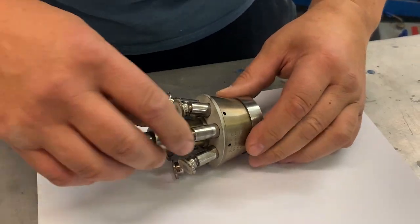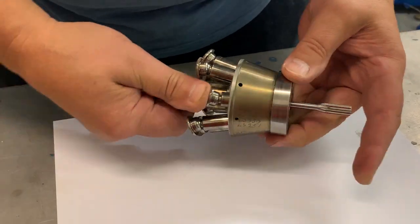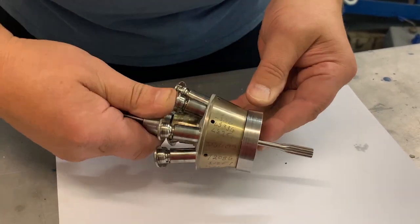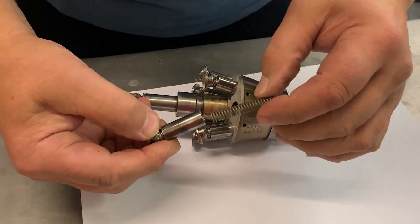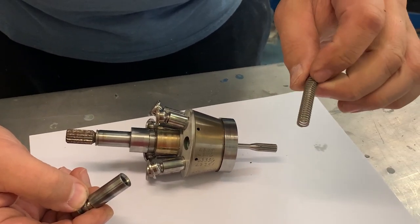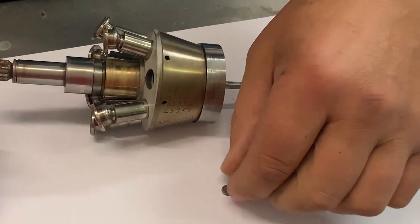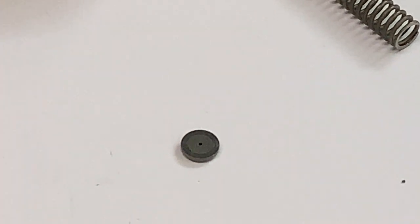The important things are the little pistons — these are the things that syringe fuel. When depressed, they suck fuel in through the back; the rotor turns and squirts it back out on the other side through a little port. Each has a spring in the back, made from shot-peened wire. The wire has a hardened shell on it, which means it can perform beyond the theoretical capability of the metal it's made from. Inside is a little spinner that makes sure the spring gradually turns, with a tiny hole to allow a little kerosene to lubricate the piston.